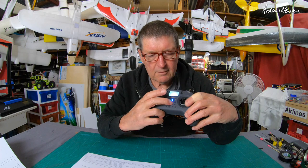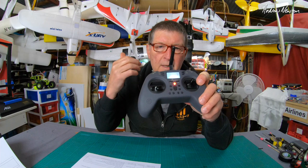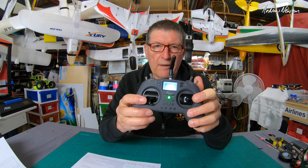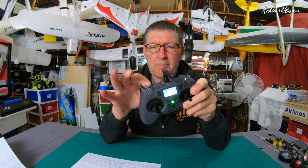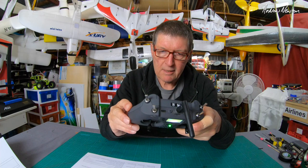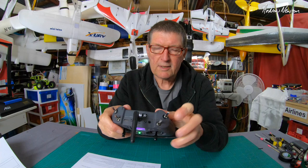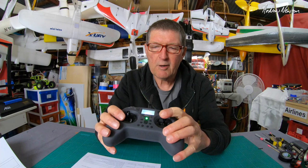Let's turn it on. There we go. It has a 1.3-inch monochrome screen. If you download the voice pack or the SD card contents — I'll give you a link in the description — you also get voice commands. I've actually got the Amber voice on here because I like the sound of Amber's voice. Hall sensor gimbals, USB-C data and charging there. It will internally charge the 18650 battery, which is really cool. We also have the 3.5mm plug there — that's probably the trainer port. And a couple of holes here for screwing on a mount, and a removable antenna so you can swap for other antennas.